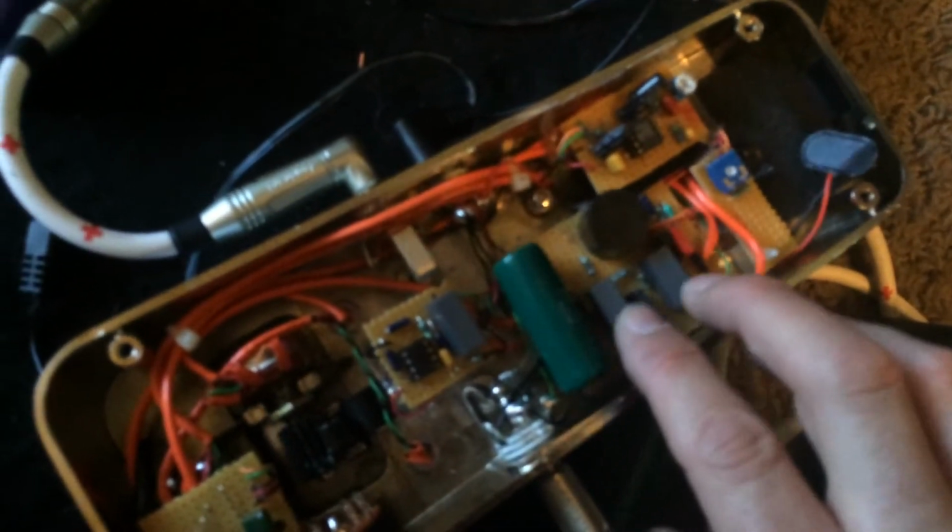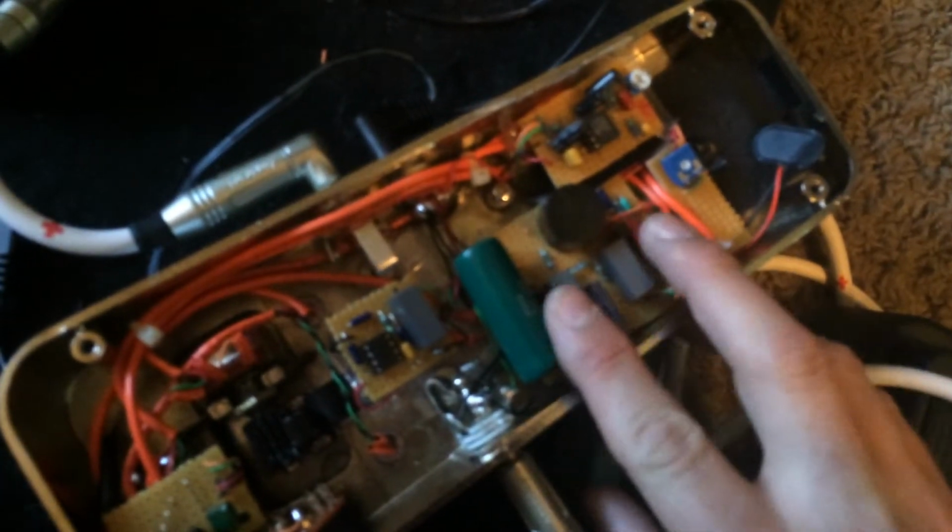You'll notice this giant gumby right here. I did that 5 microfarad to ground cap. A lot of people don't do that. They leave the electrolytic. I think a non-polar there sounds badass. This cap is ginormous, so it just looks rad. Here's that big old fat, kind of like a stack of dimes style inductor, even though it's in a trash can. These guys are the in and out caps for the wah type circuit.